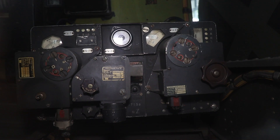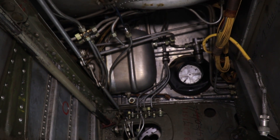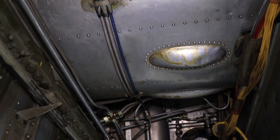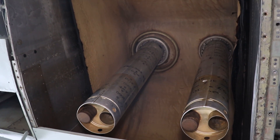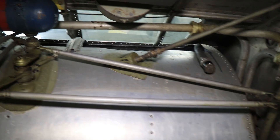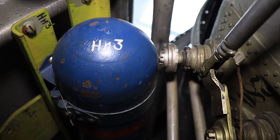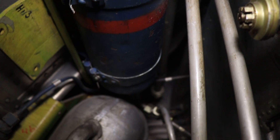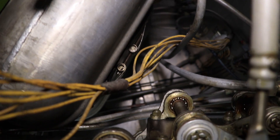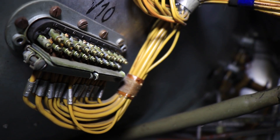At the museum several of the lower cover plates are detached, which gave me a good look inside — it was quite incredible, I nearly forgot to film at one stage. What you'll see here is the section in front of the pilot between him and the guns, including a cutaway window on the port side. These tubes are the fuel pumps, one per each engine, and you can also make out the rubber lining on the side of the tank. Just below the pilot there's the blue tank for compressed air, and lots of wiring coming from the cockpit. The zip ties are not exactly WWII Luftwaffe standard, but it's very nicely maintained.